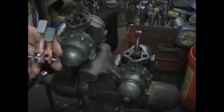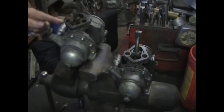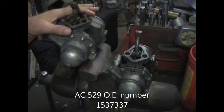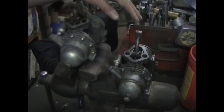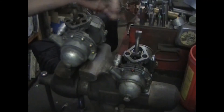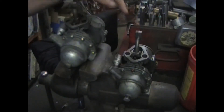It could also have two different numbers stamped on the flange — the mounting flange, right around this edge. Sometimes they'll stamp it across the top. On the 529, which is the 40 and 50 series, it would be 15, 37, 337. On the 530, which is for the bigger models, it's 15, 37, 338. Both of these pumps are identical — they all take the same parts except the arm. You can't substitute one for the other; it'll either break it or it won't work.